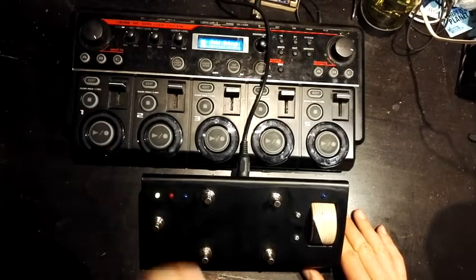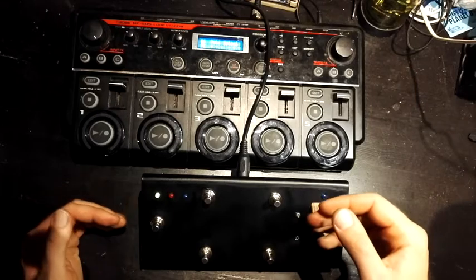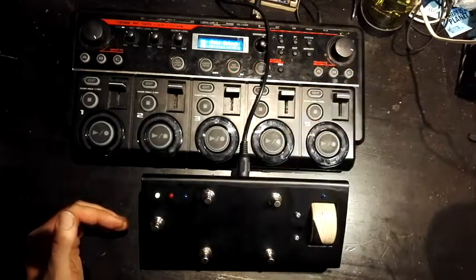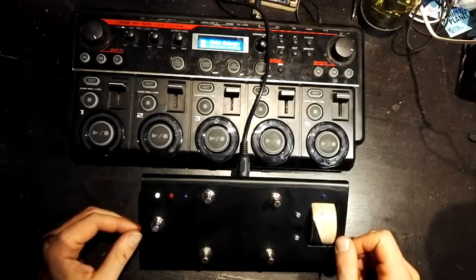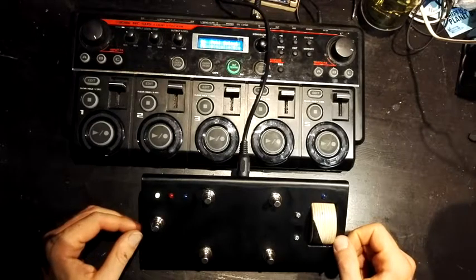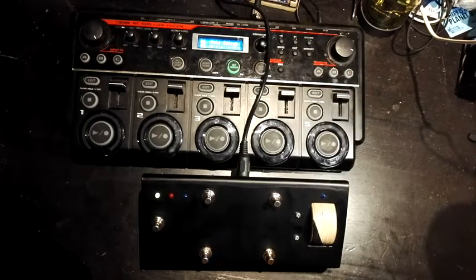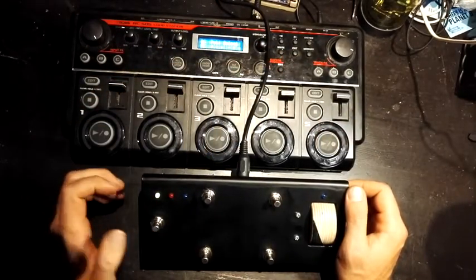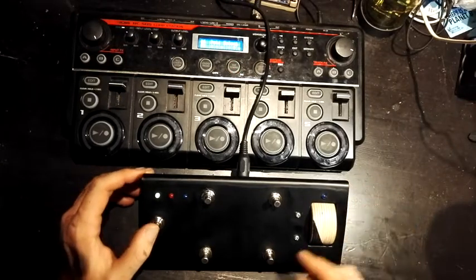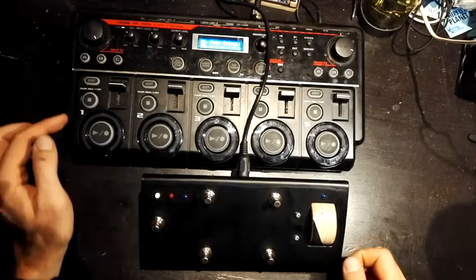The pedal will not say play track 1. The pedal will only send command change numbers, and you tell the looper what to do with these command change numbers. The looper can accept up to 16 different command change numbers, and you are the one who defines what the looper will do with it. I defined in this memory slot here that the command change 1 to 5, so 1, 2, 3, 4, 5, will all be record and overdub and play from the tracks 1 to 5.